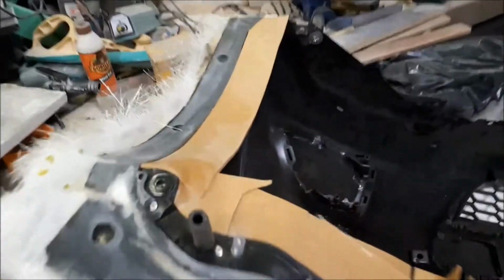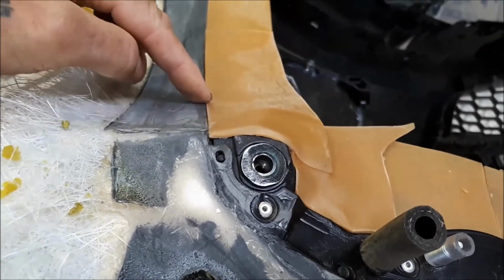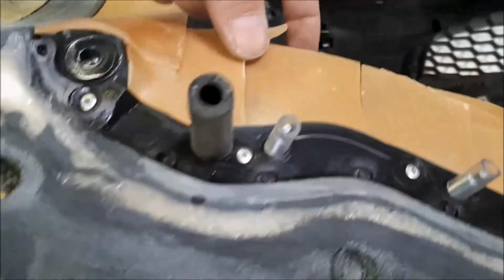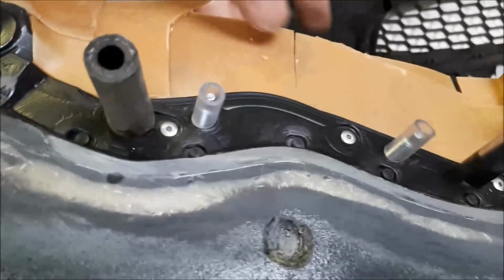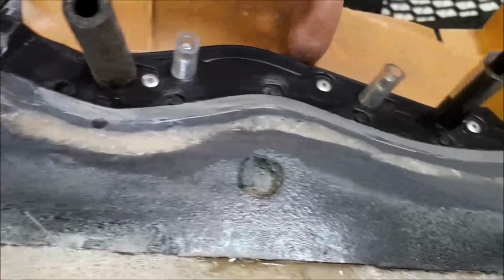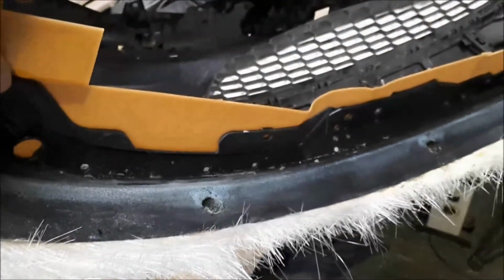Right, let's get you guys back up to speed. So there we go. I've got all the wax on. Not wax on, wax off. So focus. There we go. Just a little bit of sealer to go down the edges there. That's okay. I'm not that bothered about these bits here. It's only just to hold the glass in place, so I've got an edge to lay up onto. I'm going to be cutting back to this line here anyway, so all this doesn't really matter. I just need it there for making the mould. So we're all okay here, around there and down the other side.